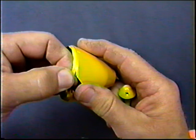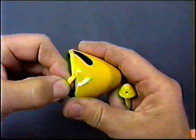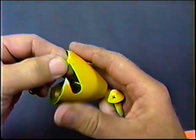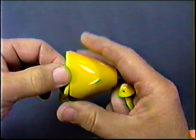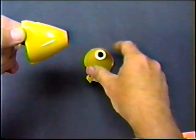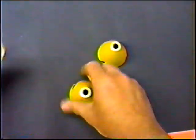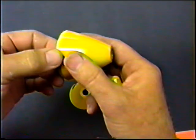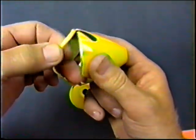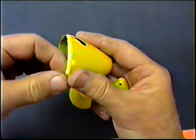And of course, with an aero spinner, you want to keep this ridge paint free. And we're going to use carbon backplate, unless for some ungodly reason we need a lot of nose weight. I have one spinner for a 2-blade, one for a 3-blade. We've been working with 3 blades, but obviously I'd like to have both of them working. This is a key part of painting up one of these spinners. Don't get paint in that groove, because that's where it tends to peel, and then it'll peel back over the nose cone.